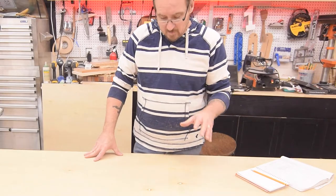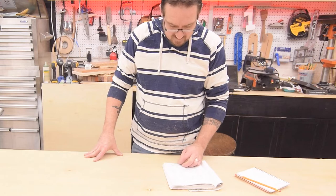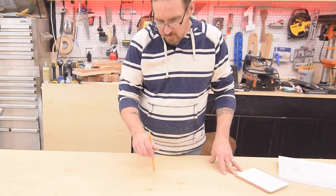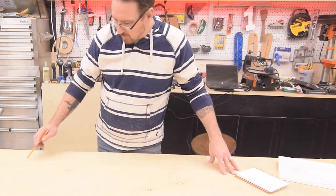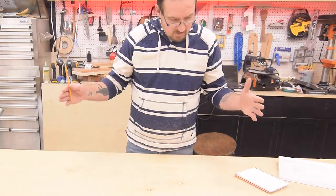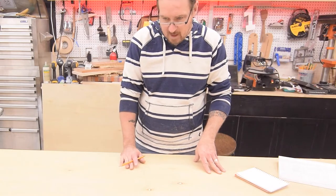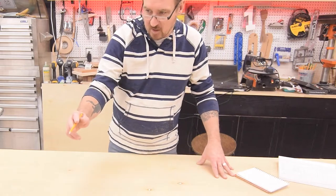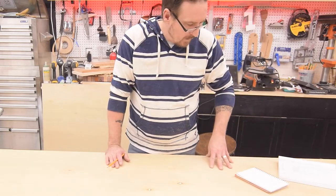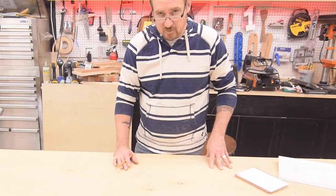I've got the back cut. Now I'm going to cut the sides at 23 inches deep and 37 and a half inches high. Normally I would cut my long cut along the grain, but we're going to have a washer and dryer on either side of this box and the back faces the wall, so it doesn't matter. I can get better use out of my three quarter ply by cutting my length against the grain since nobody's going to see it. Really the only part we're going to be concerned about is the front. Let's cut these two sides to 23 by 37 and a half inches.